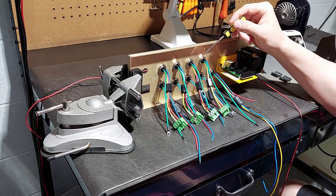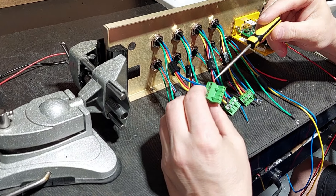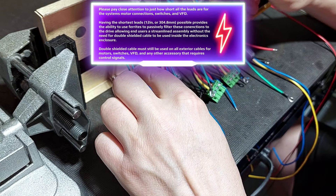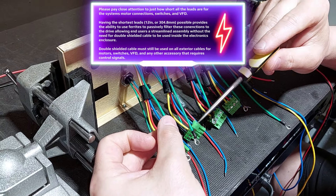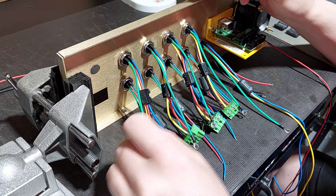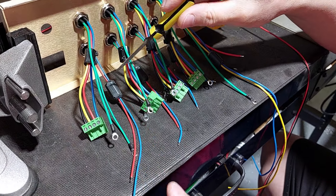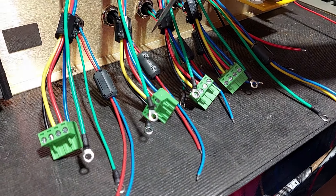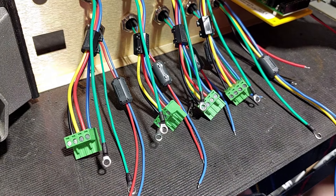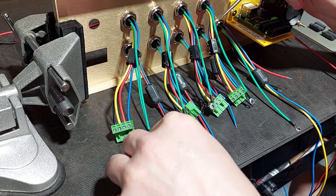You can see all of our motor connectors are done and everything is installed. We've got our four-pin connectors for our motor drivers, and then we have our ferrites. The ground leads with ring connectors are ready to be allocated to our ground bus — that's for all four axes. Underneath each of these you'll notice another ferrite, one through four, and that is for our switches.